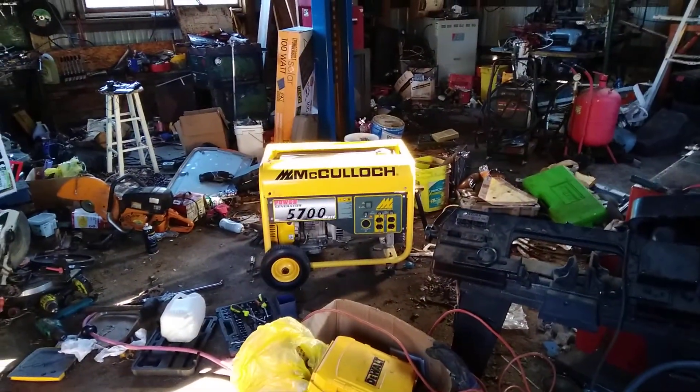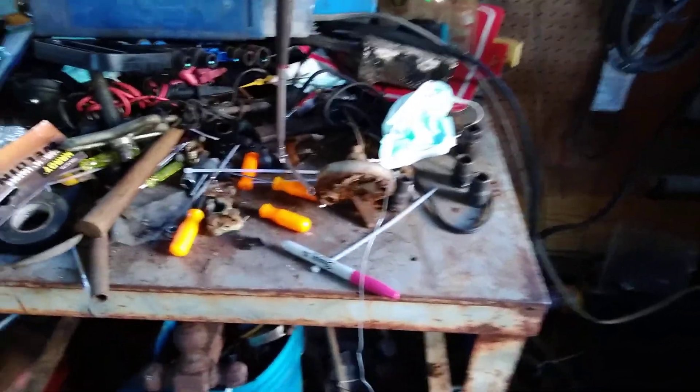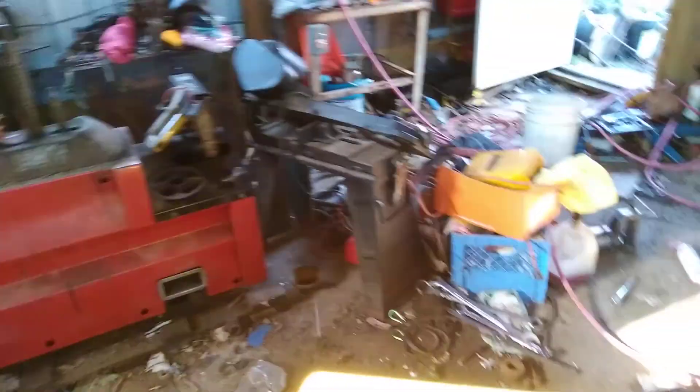What I'm going to do with the generator is put it over here and move this bench where I can actually use it — get it cleaned off for some of my projects. I'm going to move the generator over so I can wire it right into the service. Then if we have a power outage, I'd be able to run it in the house by shutting the main breaker off, and probably disconnect the 220 hot water heater, and I think it'd pretty much run the house.